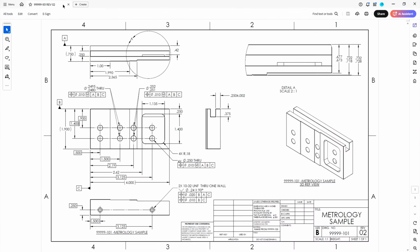If we look at our drawing, we have these four holes. We have a loose tolerance on the quarter inch. We have plus or minus 5 on that. So we're going to set up a drill bit that can cut all of these, and then come back with reamers to do the other two holes. So we're going to utilize this tolerance, and we need to go with a tool that's smaller than our smallest hole, which is, we're allowed to have this 248, okay? So we can't use the standard quarter inch drill that was in the library. We're going to have to build it. Okay, so let's go and build that tool first.